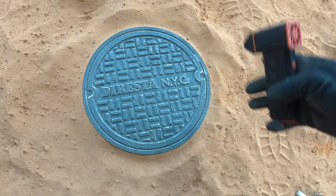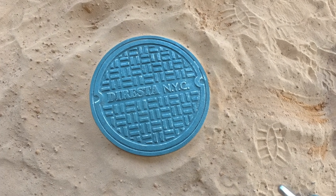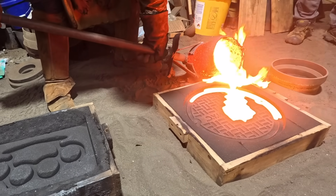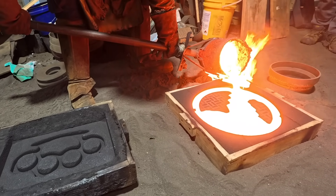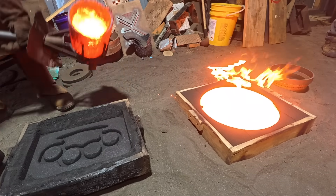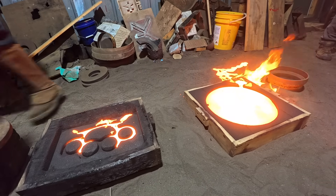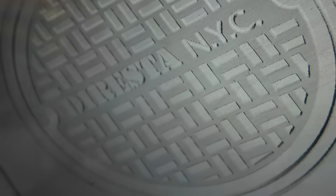Later that same day we did another one, but the back of the mold fell apart as we were moving it. So here you'll see just pouring it into the open face — it was running late in the second day and the next morning I was going. We tried to do another set of knuckles which didn't fill in all the way. But here you see I go from art to cut to using an altogether different process to end up with a real solid steel sewer cap.